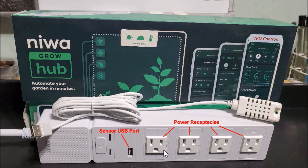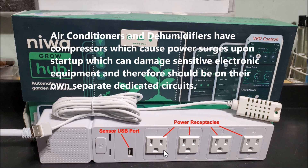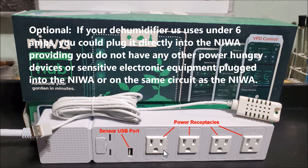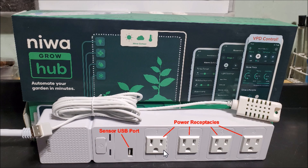Concerning air conditioners and dehumidifiers — they both have compressors which cause a power surge when they first kick on. That power surge can have negative effects on other equipment on the same circuit. You don't want to ruin your expensive grow light, TV, computer, or anything else with sensitive electronic circuits. That's why you should always have each of them on their own separate electrical circuits — a separate circuit breaker in your breaker box dedicated just for that appliance.